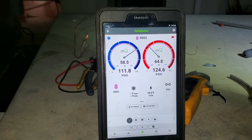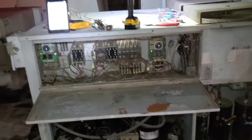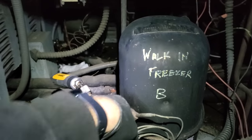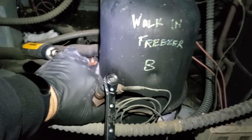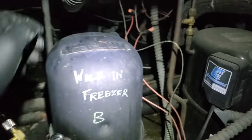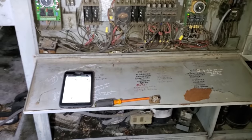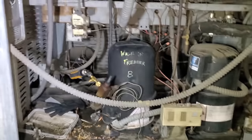I'm using smart probes. That's problematic. Not gonna be a fun night. It doesn't add up though. I wonder if my probes are messed up because these compressors. Discharge line feels cold, so nope. Well, yeah, this sucks, man. Bad compressor. And they have to have it replaced tonight.